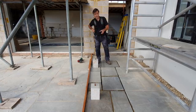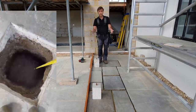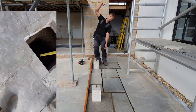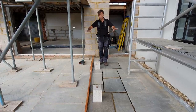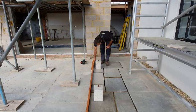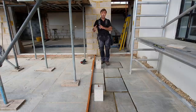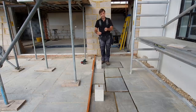Before we cut these into this freshly laid paving, what we did was excavate two pad foundations. They were a metre deep, mass filled with concrete, back up to this — what used to be an outstep here. We're going to now set these out with a rod. We'll transfer the rod to the oak frame for the centres, so it's no measuring once we've marked them.